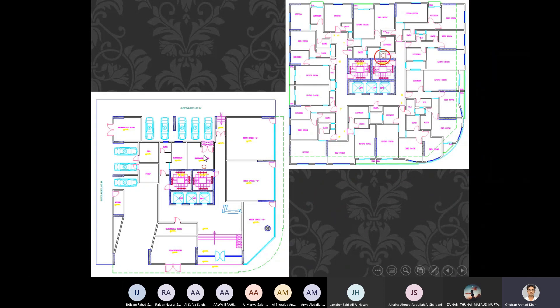In the next picture this is also a ground floor plan with a 3-meter setback. You can see the staircase, and after the staircase there is the garbage chute — this is actually the garbage room where you have the biggest receptacle. In the upper floors, the same position holds the garbage chute itself, which doesn't require too much space. At ground floor, it is connected to the outside; there is a ramp, a door, and a room for the garbage area.